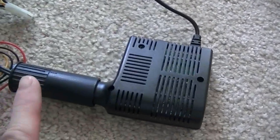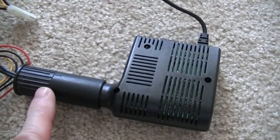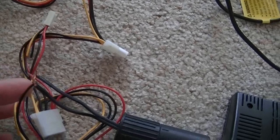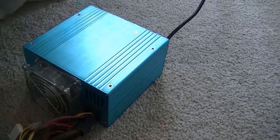What you can do is, down at Radio Shack or other places, you pick up one of these female cigarette lighter adapters. You just cut the wires off the end, then you attach those wires to your yellow and black leads off of an old computer power supply.